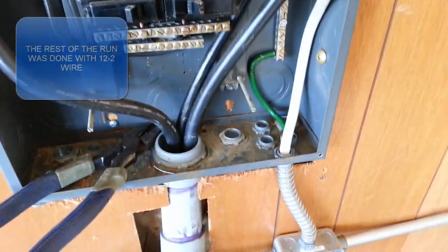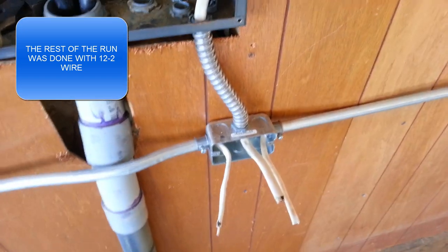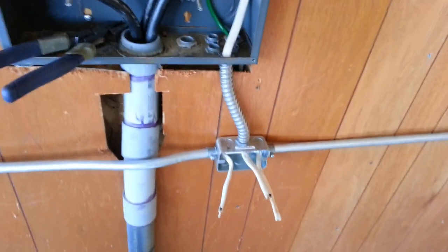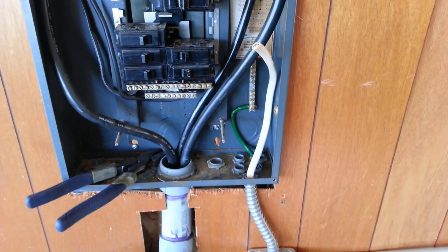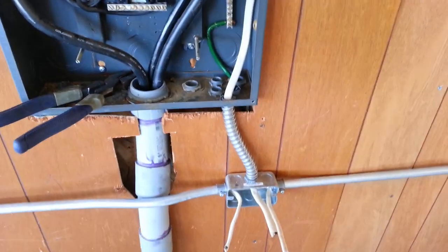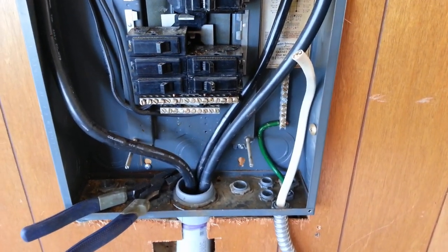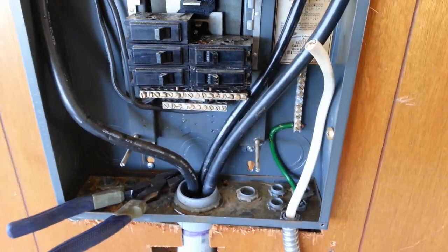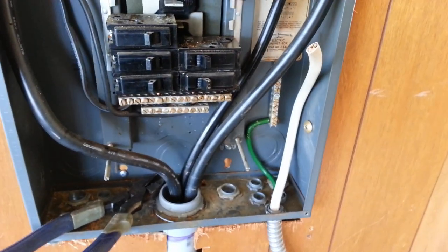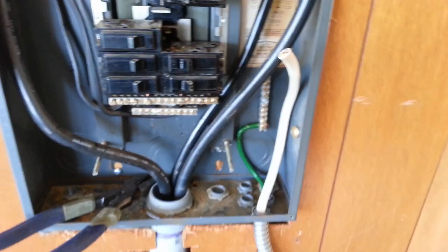I know it's a larger size — probably a no-no in the electrical world, but that's what I did. So I'm going to go ahead and connect up to the breaker, connect my ground and my neutral, and then start doing box makeup. I'll show you the connections after I'm done. I'm just going to tie into that bottom breaker on the side that the Romex is on.